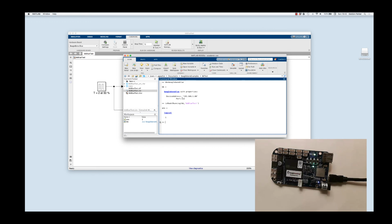So now let's go ahead and stop the BeagleBone. And I'm going to time this so that I stop it when the green light is off. That way I won't have the green light stuck on forever. Boom, just hit enter, and I was able to stop it. And I can check that just by having a look at the is model running again. And now it returns 0.